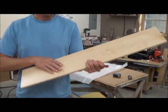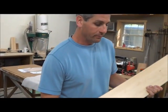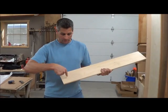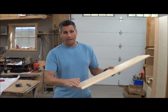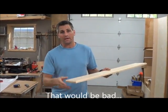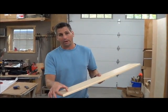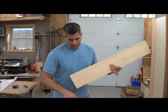In our demonstration here, we've got a slab drawer front, so it's very, very easy to do. If you're doing a 5-piece drawer where it's got a floating center panel, you have to be very careful where that screw comes in, because you could come in on the face of the door or drawer front. You have a panel raised. You don't want to come through that thin part of the panel. The screw tip will poke through. So you want to keep your screws as far to the outside as you can. If it's a 5-piece drawer front, you want to catch the outside frame rail, not into the panel area. You want to be as far to the outside as you can.